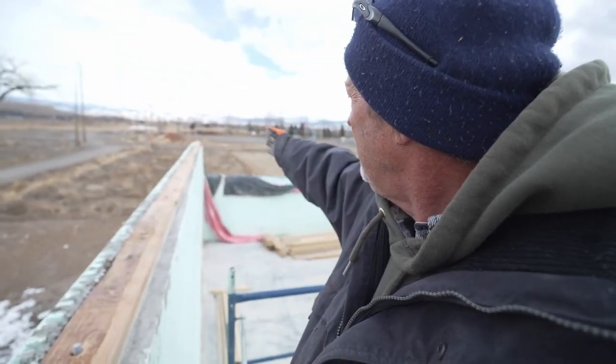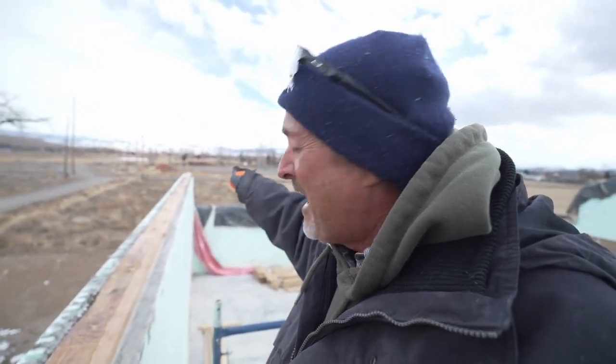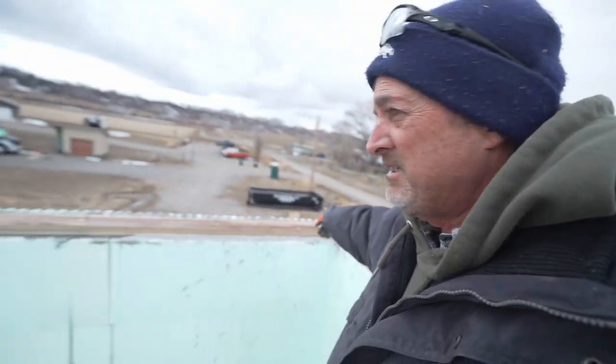see, that's the west wall all the way down, and we're 3/8 of an inch too short. So I need to push that board that way longer, make this length a little bit longer so that the trusses fit right on top of that block perfectly. This is the basis over here because I can't move that. That concrete isn't going to move.